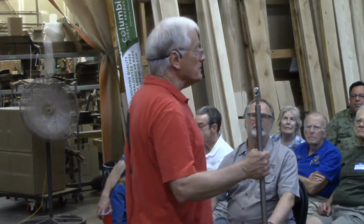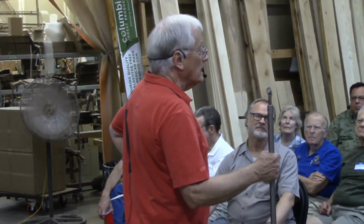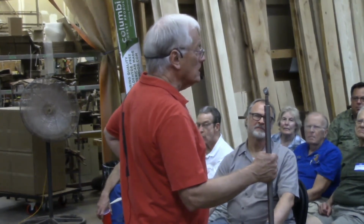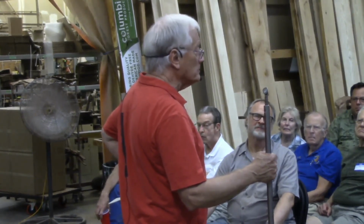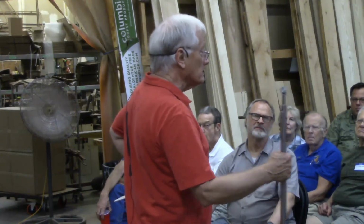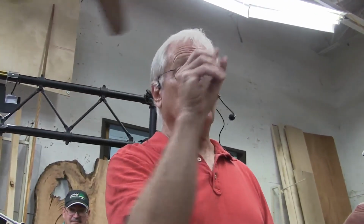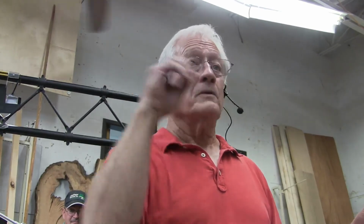They are stripper blades, and so if you think of aircraft harness systems and automobile harness systems and things like that, there's a lot of connectors, and they're auto-stripping wire to make all these complex harnesses. They have these massive machines, and if you want 10,000 22-gauge wires with the end stripped for a crimping machine, because you're going to crimp a contact on the end, then you send it through this thing, and it auto-strips the wires and stacks them neatly.